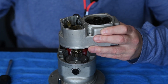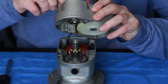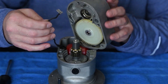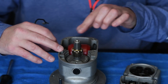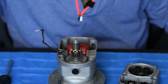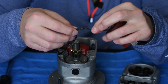Once we get those screws removed, we pull the housing up. This part right here can be a little tricky — fishing this wire through this housing. We've got to be really careful that we feed it through very gently and that we don't catch anything on the way out. Now we've got this lead removed from the housing. Inside this housing, we've got a little area where when we go back together, we've got to make sure that we place this wire in the correct position. If we don't, here's another coil from another project where you can see the insulation is pretty well damaged from smashing it inside of the housing.